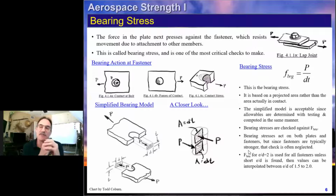the hole and the fastener are the exact same diameter. And we're going to use the nominal diameter for that. In fact, if we have a 1/4 inch fastener, the fastener isn't a 1/4 inch at all. It's something just less. And if we have a 1/4 inch hole, the hole isn't a 1/4 inch, it's something just more. A proper drawing will actually have a tolerance specified, so the hole has to be a prescribed amount larger, plus something but not minus. And a fastener will usually have two limits, both of which are smaller than the nominal size.